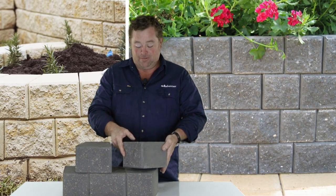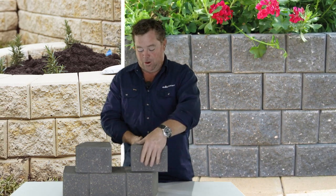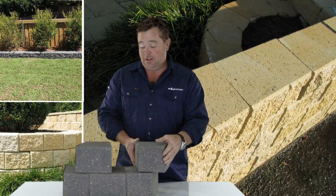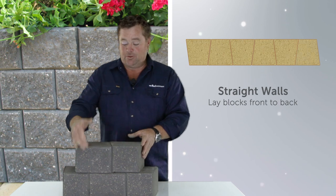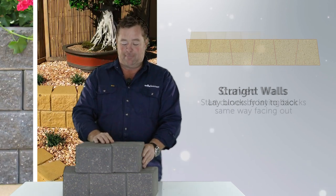I like them because they've got the big face at the front here, which is about 180mm wide, and at the back you've got exactly the same face, but it's smaller. So if you alternate between large and small, you have no gaps across the top, and you don't even need to worry about a capping stone.